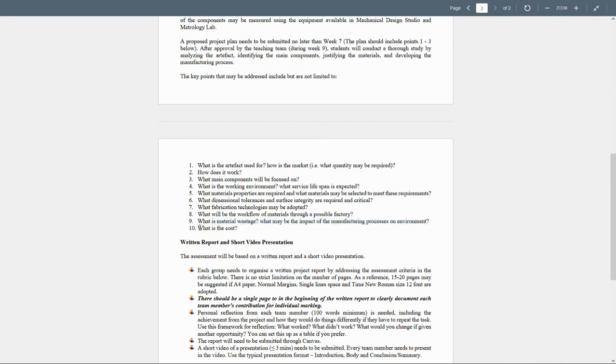For the cost, if I make the parts, the impeller once again, or the body, using die casting, and I make a mold which is going to cost me $200,000, I can use it to make 500,000 parts. So definitely this will be more economical than making patterns and doing sand casting time after time. Unless we're going to make 1 million parts, sand casting is not going to be more economical than die casting. Now the question is, can we make the parts by machining? You have to search that yourself.